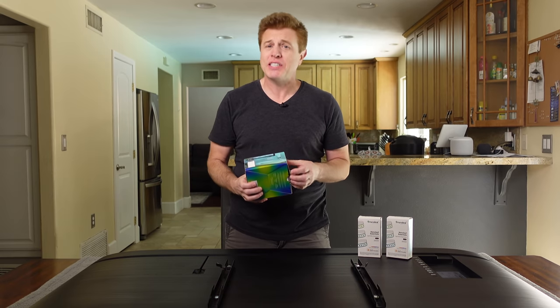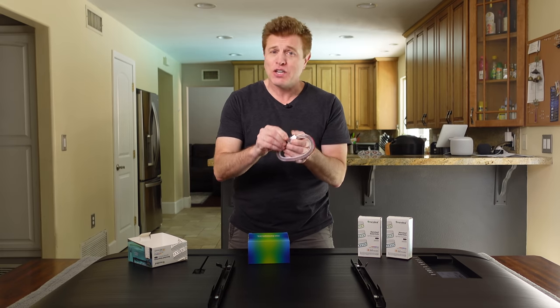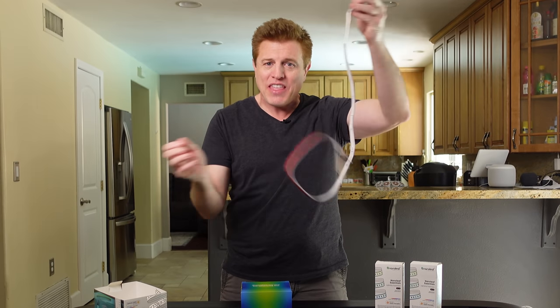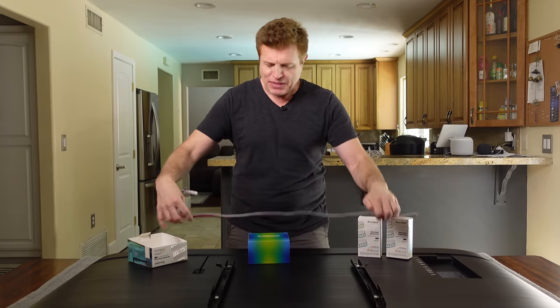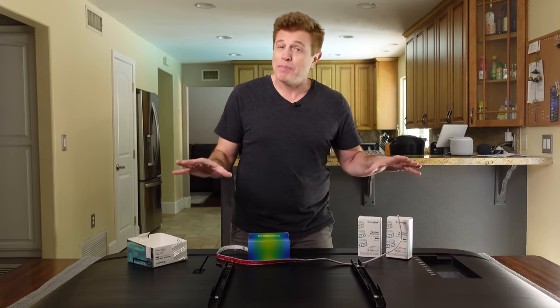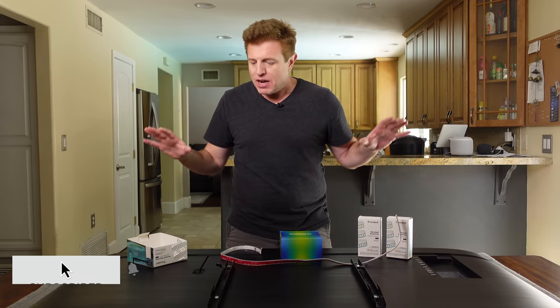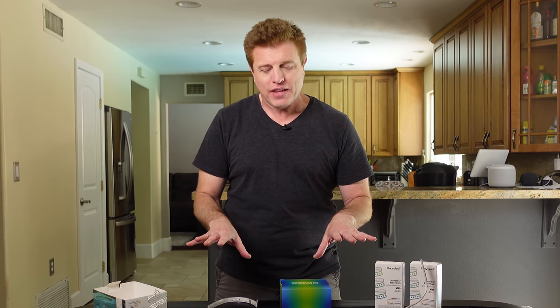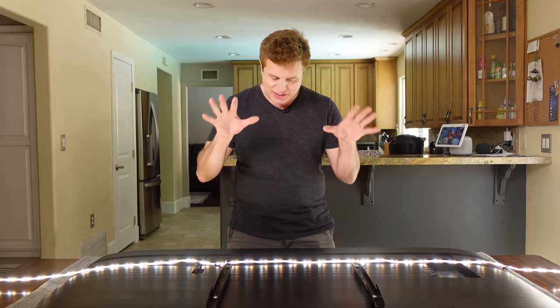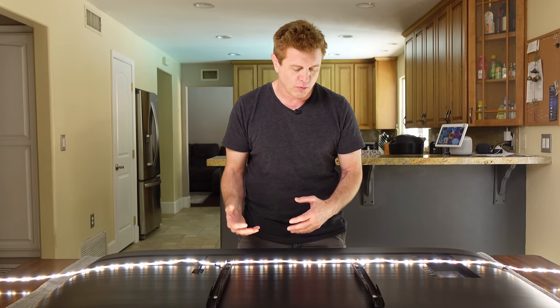One of the first things I do when I get strips is heat them up. Often the strips are wound up tight and they don't want to lay flat, which makes it difficult to create a gentle bend. Get them out of the box and warm them up. Also, make sure to wipe down your TV — I used rubbing alcohol on the whole back of my TV so that any oils from your hands, dust, or anything else is gone and you'll get a good attachment. I've got them plugged in and turned on with a blend of warm and cool white to start heating up.